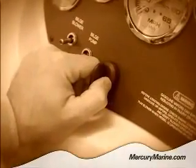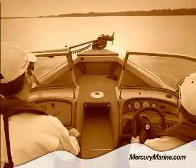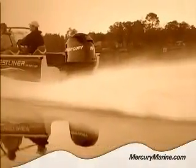To do that, we generally recommend topping off your boat with fuel, but keep it otherwise lightly loaded versus a typical outing on the water. We generally recommend warming up the boat for about five minutes, getting the engine to the right operating temperature, then finding a wide open piece of water where there's not a lot of other boaters. Give it full throttle, trim the engine up for speed, and once you've maximized your speed, record what your wide open throttle RPM is.